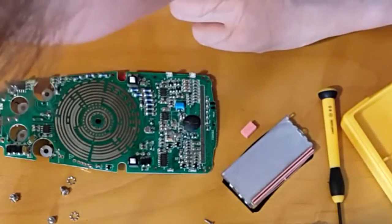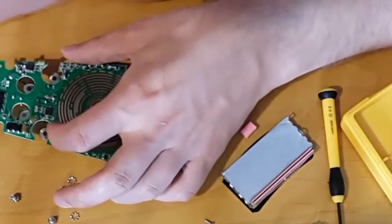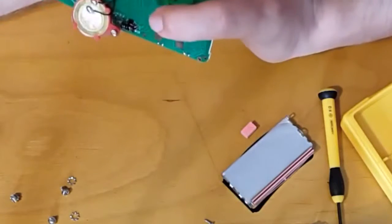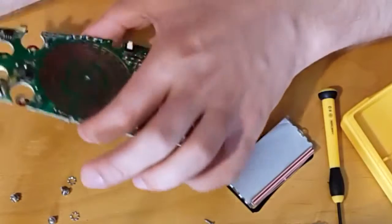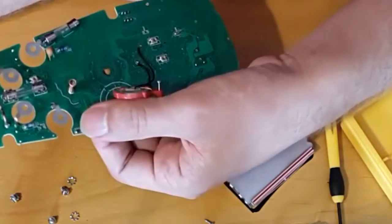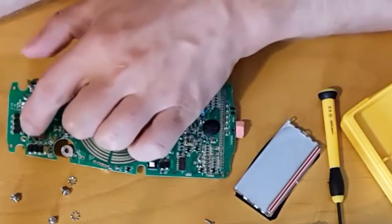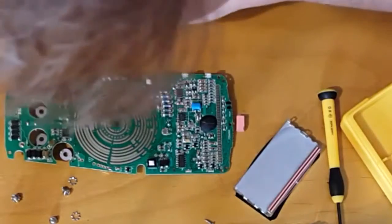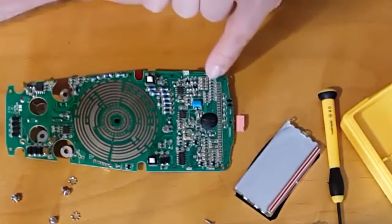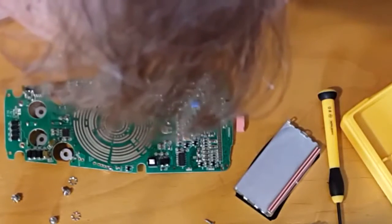There's nothing that stands out as obviously wrong, which is what's most worrying about this. There are a few rough spots on this board — look at that, that's been scratched up. And that soldering is a bit iffy. That's soldered in — a soldered-in fuse, so not user replaceable that one. That one's terrible soldering. The front side is still pretty shoddy actually. I'm expecting that to have come through and formed a nice little tent on the back there, and some of this is a bit iffy. Obviously this has all been done with solder paste, so these are quite nice — but that I don't like. These four here are going to make up your backlight — so these are going to be LEDs to light up the backlight.